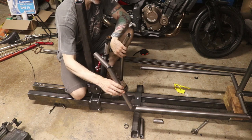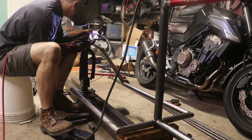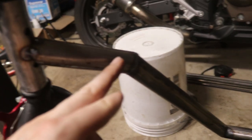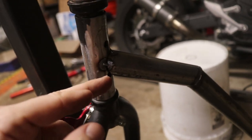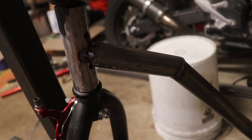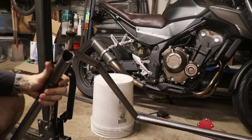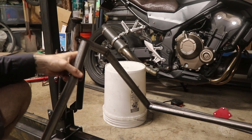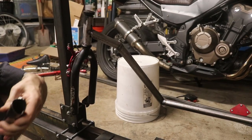Right now I'm going to go ahead and tack this stuff in here. We've got it tacked in on that one side — a spot there and another spot on the other side. This main piece we did earlier has two tacks, and the section up here has three tacks — one here, one on top, one on the other side. Now to put the second piece in, I need to notch out this corner right here because they're going to overlap slightly. Then we'll tack this in.